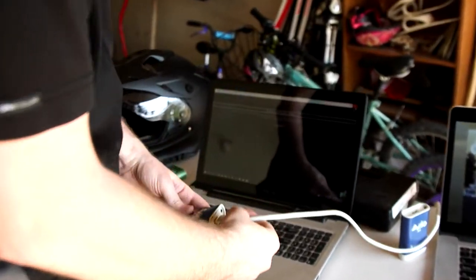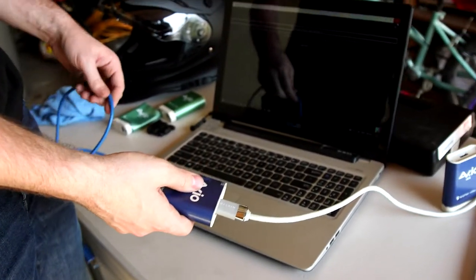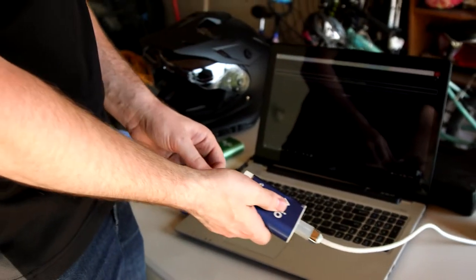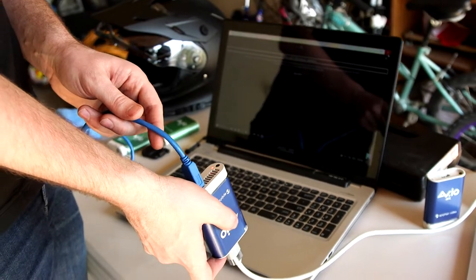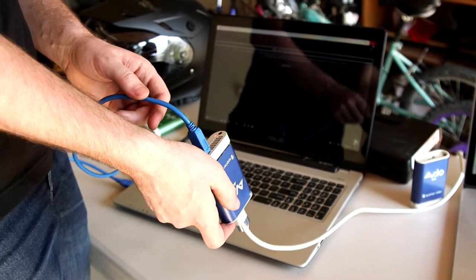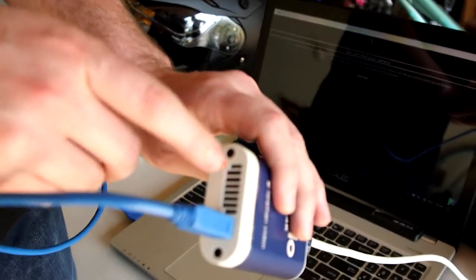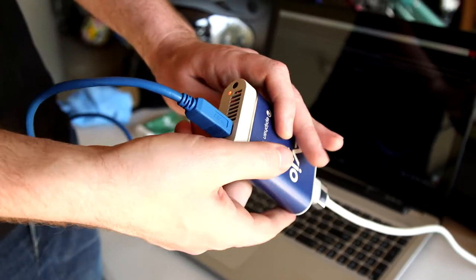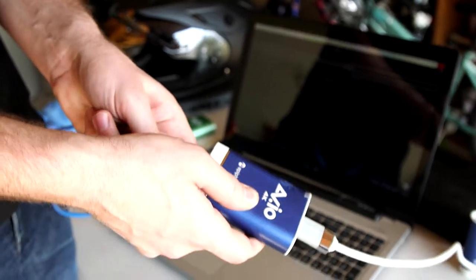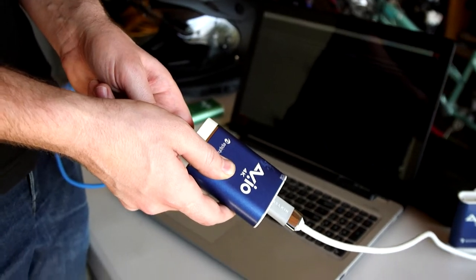This is a real world test — here's your high humidity test. 100% humidity. It is powering up, but not initializing. One of the things you can do as a great diagnostic on an AVIO device is look at the LED color. If it's blinking blue, it means it's in USB 3 mode. If it's blinking green, it's in USB 2 mode. If we're getting a solid red light, that indicates we're getting power but the host system is not detecting or initializing it properly. It looks like something on the inside didn't enjoy that swim as much as George did.